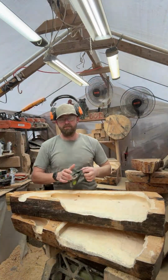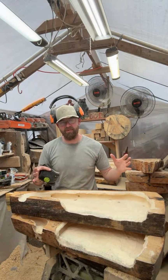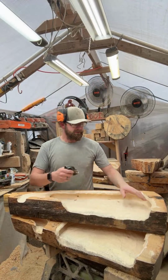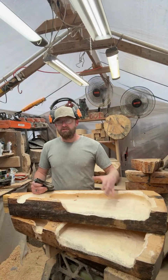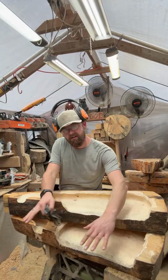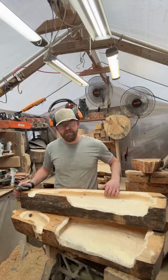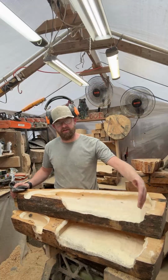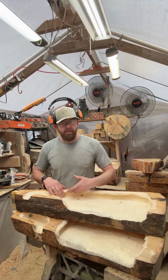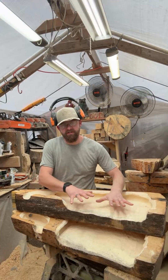So the plan is, right, we got 15 steps that come down around a tree trunk in this massive camp in Lake Placid, New York. Right on the water, big beautiful place they're working on. Went in, commissioned to go in with the customer. We drew up this flowing stream to go down and around the staircase. And now I'm carving up each individual stair tread based off what we already drew. Now, we're going to end up adding LEDs around these grooves, so they'll glow into each step.